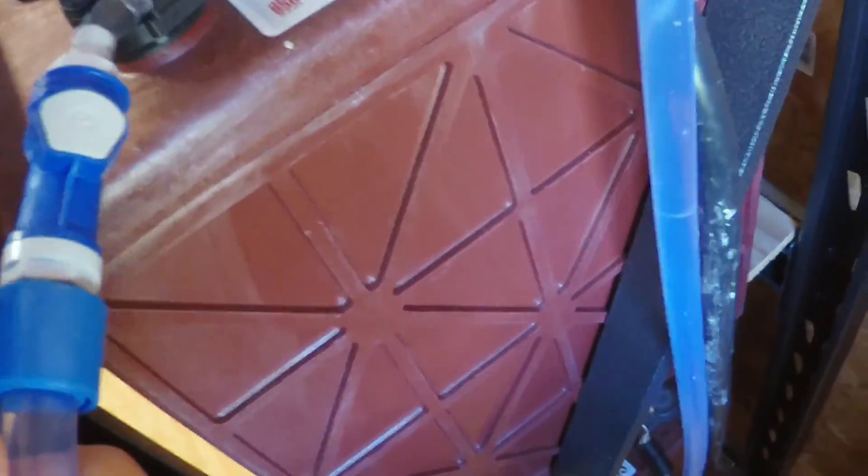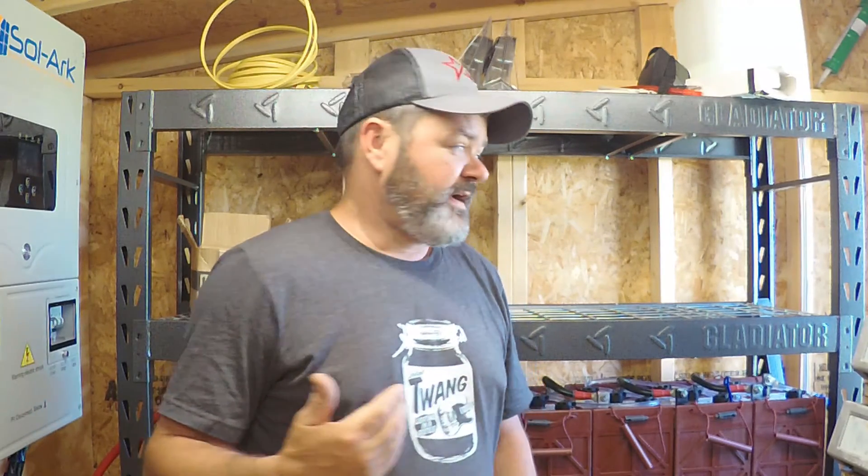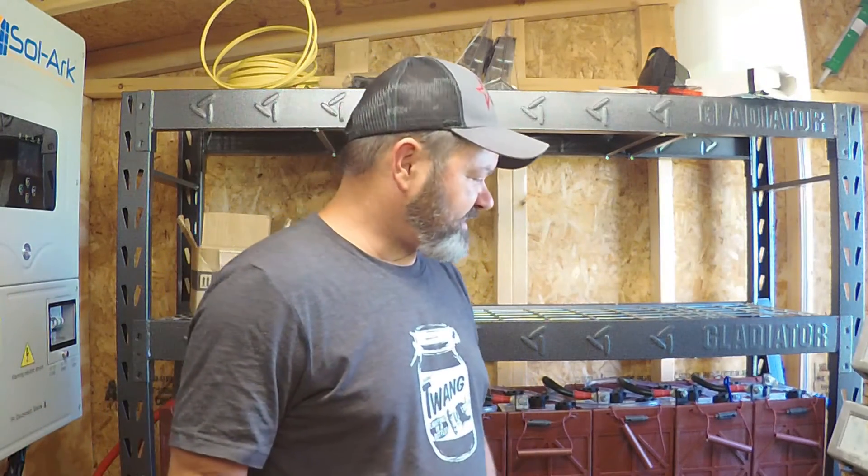For my second bank of batteries, I'm going to reinstall the valve I removed earlier and then connect the hose to the bottom bank and service those as well. Those are all from Battery Watering Technologies — you can contact Scott Hunt at Practical Preppers LLC, also known as Engineer775 on YouTube. I'll put links in the description to the entire system: the tank, all the valves, everything. The order is custom-tailored to you. It's about $200 per bank for all the valves and tubing, but if I had to water each one individually, it probably wouldn't get done as often as it should and I would lose battery life.